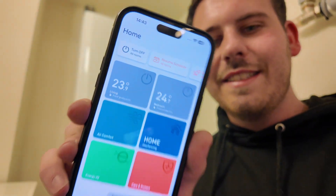Now we turn them down to zero, turn the bedroom down to zero, and make sure it completely shuts off the boiler - just to double check everything is working as it should. We've turned them all down to zero and we just wait for the boiler to switch off - then it's all looking gravy. Simple install these Tado stats. Obviously via the app you can set schedules for certain days, set them to go on at certain times, even manage them if you go on holiday.